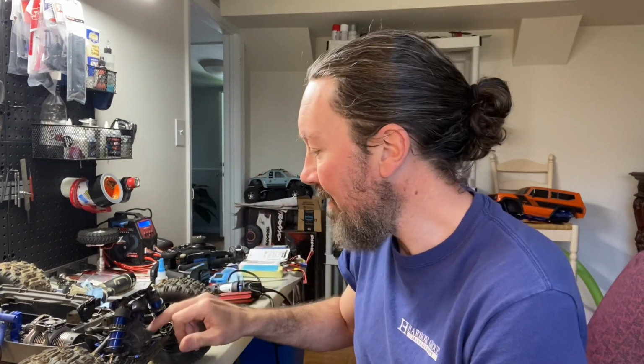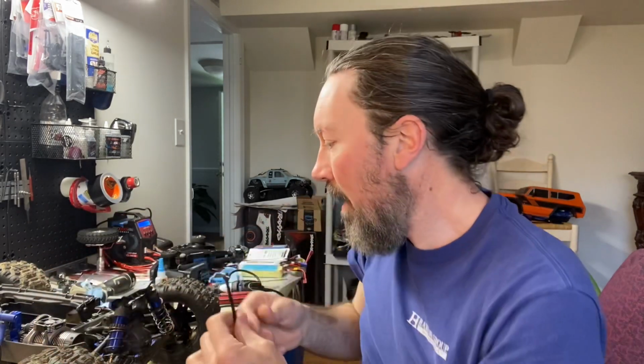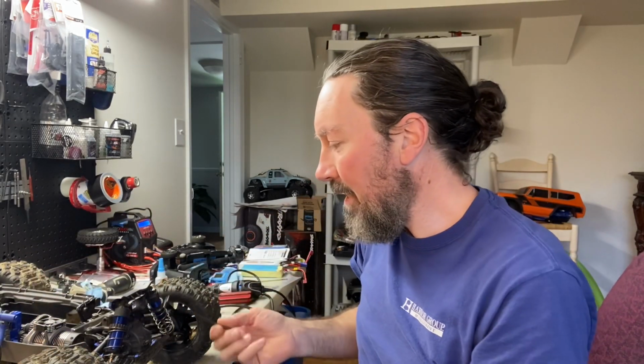and kind of get some of that metal down into that kind of corner of the dog bone here. So just this little corner here where the pin slides in, what you're doing with the chisel is kind of just wedging some of that metal from the round portion of the dog bone down into that shoulder area, the edge where the pin pushes in, and it kind of just wedges it down in there and makes it fit tight.